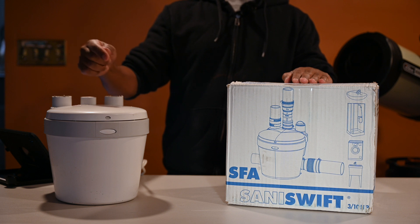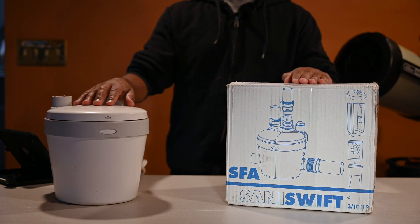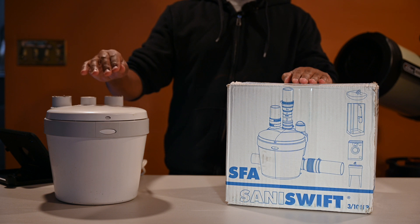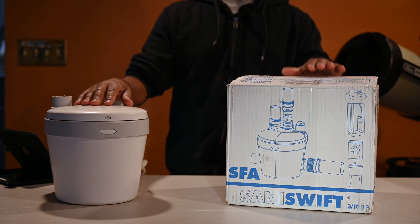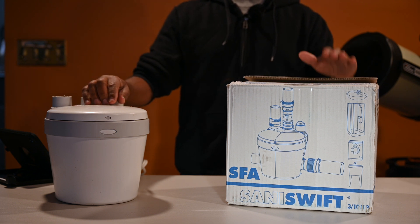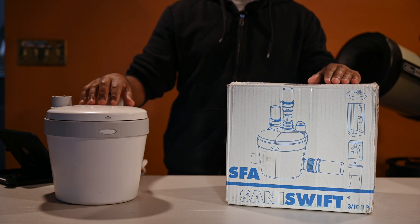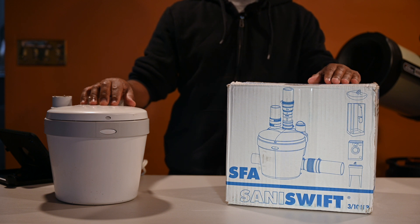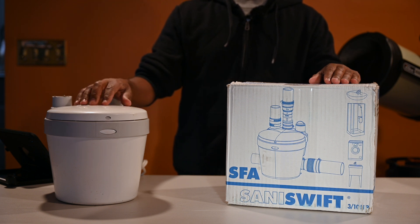The gray water is pumped through pipes attached to the sewer line that leaves the house. I built this laundry room about 10 to 15 years ago and after doing my research I found this pump fit the bill. This type of pump is ideal for a laundry room, utility sink, shower, and wet bar — it's very flexible. Unfortunately this one ended up failing; I installed it around 2011 or 2012, so it lasted at least a good seven to eight years, which for the price — about $200 — is pretty good.